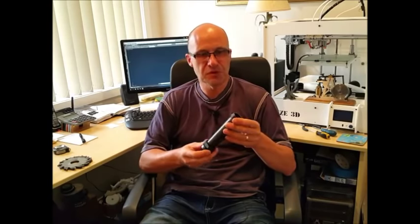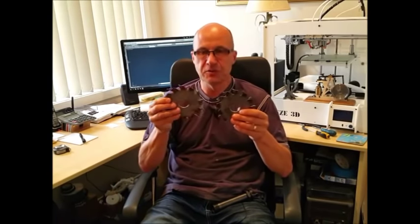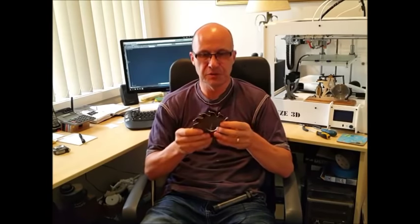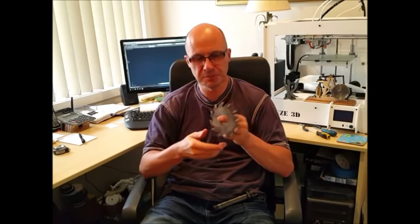So we've ordered a new shaft from the suppliers for the machine, and then we've had some blades made for us. So two identical blades, 120mm in diameter, with a 6mm cut in depth on here, but we're going to have to adjust that to suit our needs. These were water jet cut for the centres, and then the teeth have been brazed on and shaped to the profile we need to machine aluminium.